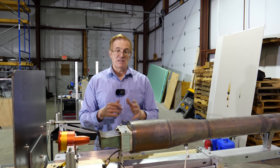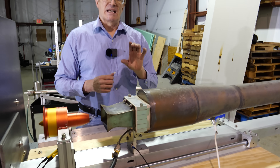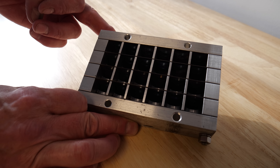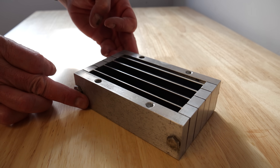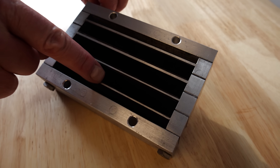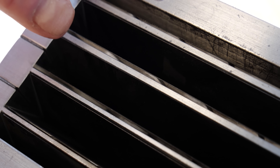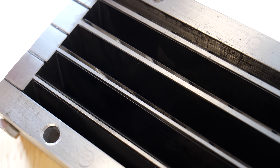While that pressure is increasing, an interesting thing happens at the front of the engine. This assembly right here is a specialized one-way valve comprised of a stack of individual spring steel strips mounted in such a way that they form a triangle with the apex aiming inside toward the combustion chamber. When the pressure increases inside the combustion chamber, it forces the strips together, closing off the front of the engine. So the only way the high-pressure, high-temperature gases can exhaust is out the back of the engine at a very high velocity. That is the momentum — the acceleration of that gas — that produces the thrust in the other direction.